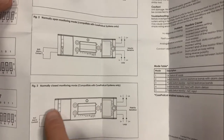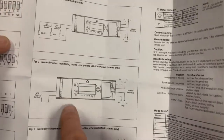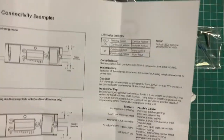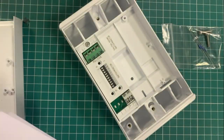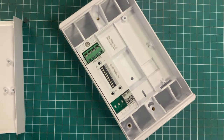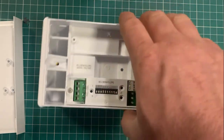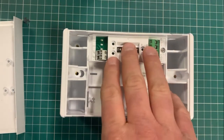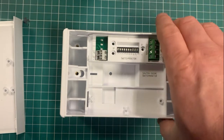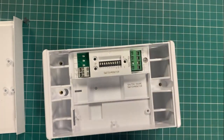The leaflet covers how you're monitoring for normally open or normally closed contacts — whatever it is you want to monitor. It depends on your resistance and setup. We'd typically see these used for gas alarm inputs and other things on site that you might want the fire alarm to monitor, so you get an input on this and it triggers the fire alarm bells or a relay.